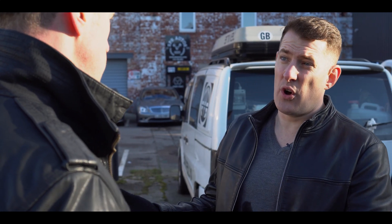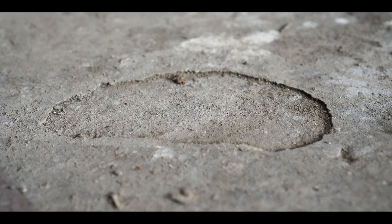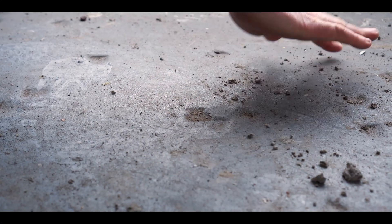If you've got a particularly uneven surface, you need to really assess the floor quality first. You could potentially grind it if the condition isn't too bad. If it's a little bit worse than that, you might want to use a fine surface filler. A step above that, you're looking at things like a screed, or in this case, a cementitious pump screed.